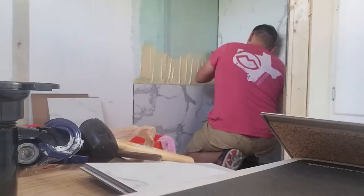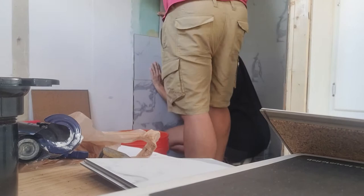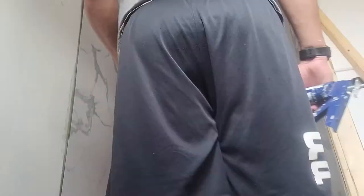Disaster has struck. We used vinyl tile on the walls and we didn't use the vinyl glue properly. We should have used liquid nails like the lady at Home Depot told us to, and we did not. It wasn't sticking properly, it wasn't drying properly, and it kept trying to separate from the wall. We kept putting stuff up all week to push it back against the wall — very mediocre job, C- on our part. Then we went in today, putting silicone in between the cracks, spraying it with soapy water and smoothing it out. We walked away, came back, and one whole wall is falling off because of the soapy water we sprayed on there.